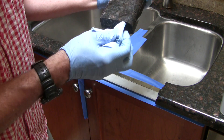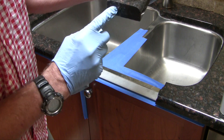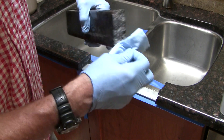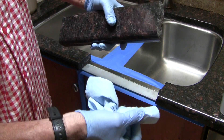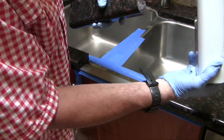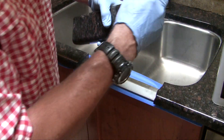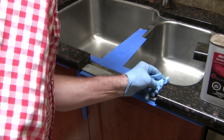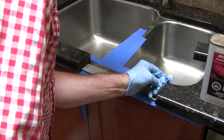If I was really careful I'd grind back on this to try and get the surfaces exactly opposed, but if I do that my total length will be shortened and the angles will be off. I don't think it's worth it. You might think that the glue is used to hold the granite to the underlying support, but that's wrong — this glue is only for the two contact points where granite meets granite.